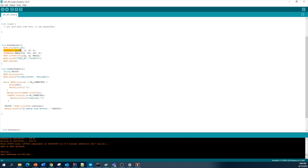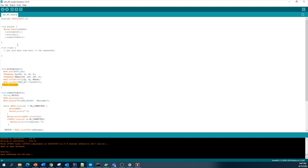You can define your IP address range for your internal network that the access point publishes, along with the subnet mask. This line — WiFi.softAP — lets you define a name and password for your access point. WiFi.begin brings up the access point once the ESP module is powered.